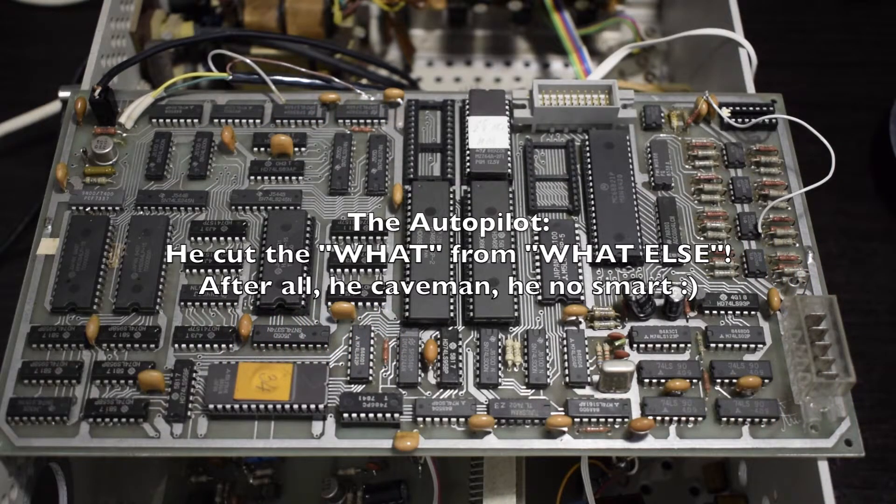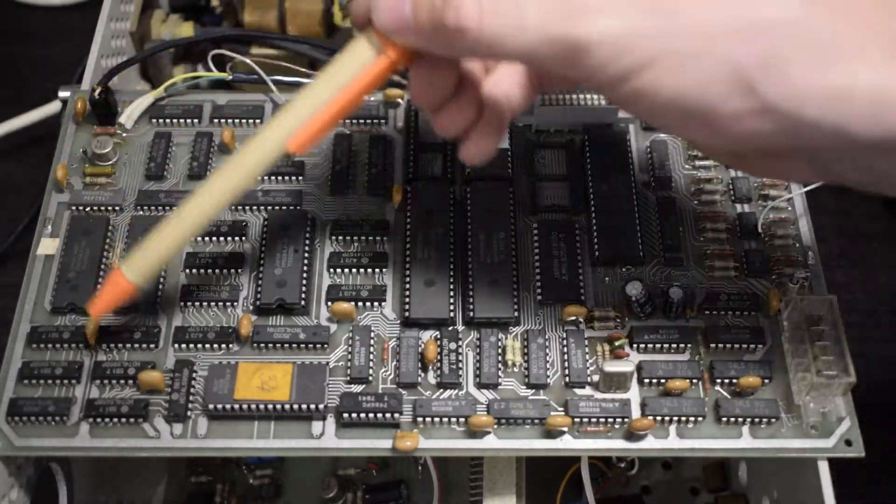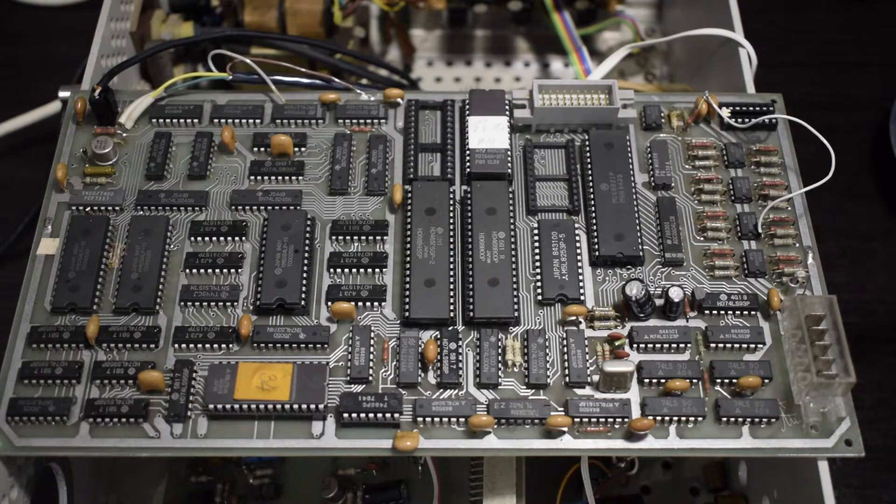Also on the board: some resistors in parallel, op-amps between them, and some aluminium and bypass tantalum electrolytic capacitors. The only bodge on the motherboard is here, in contrast with the bodge madness on the peripheral board. Everything else on the board is standard TTL 7400 logic to glue everything together. The MCU and peripheral controller are fully TTL compatible — in theory you could build everything here with 7400 TTL logic, but at that low level of integration the board would be the size of a small room. And here is the power connector I mentioned.